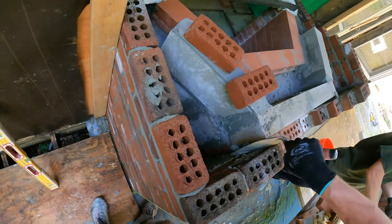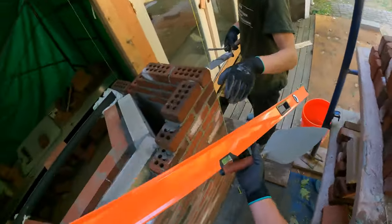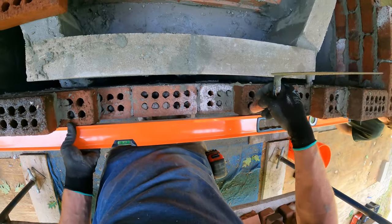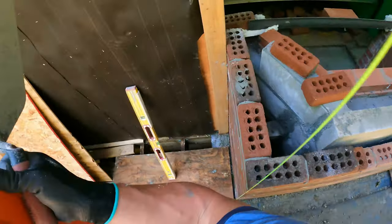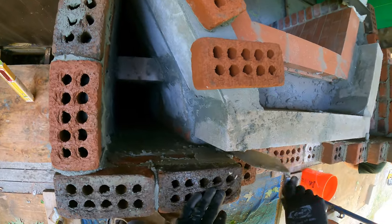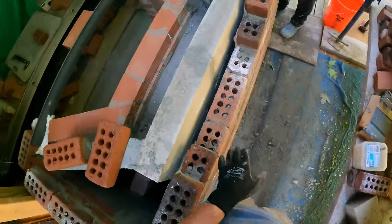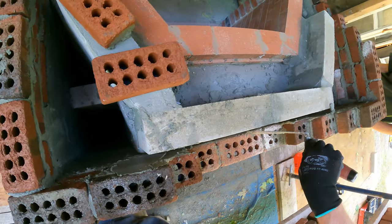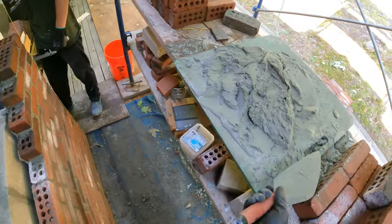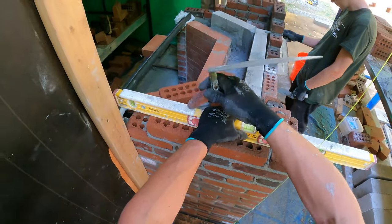You see that 6-footer behind you? Let's make sure this is going to range out here. So when you lay these courses behind here, you're only going to be able to lay these two up here before you have to parge up behind, to parge the brickwork as we go. Because you won't be able to reach if you go too high. And then when you get above the block, don't worry about it. We'll parge it all at once after, and go right up the side. They can do the whole thing right around the whole building, and then just boom, everything up at once.